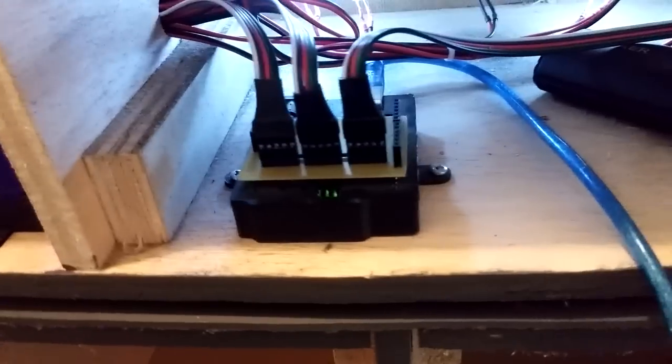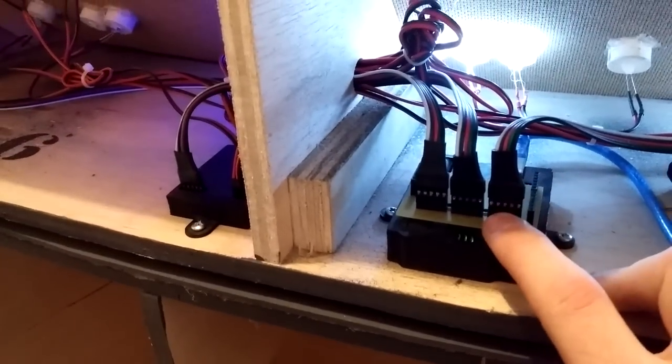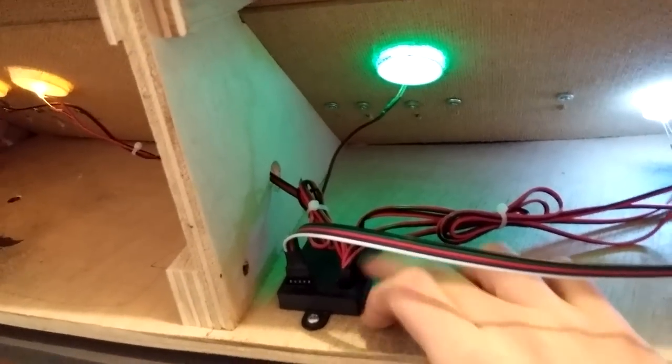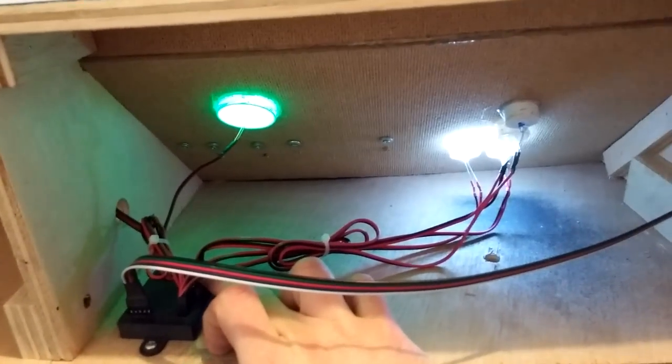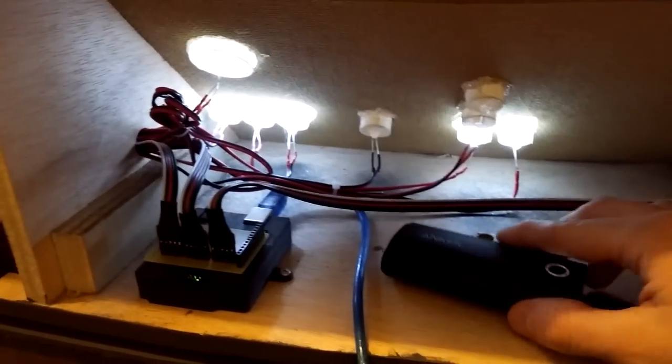The electronics were actually made using an Arduino Uno. And then I made some custom printed circuit boards like I did on my table, and they segment out to each of these boxes. They each have their own little console. And then the lights plug into these, and then I have a certain number of pins on here that do the random sequence where occasionally they'll blink or turn on and off, and so on. And the whole thing runs on just a USB cell phone charging battery, and it lasts all day, so it's pretty great.